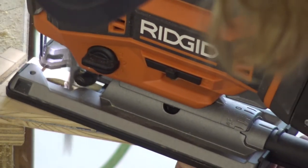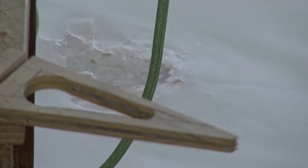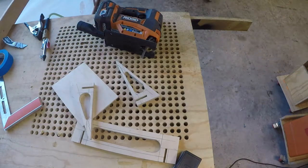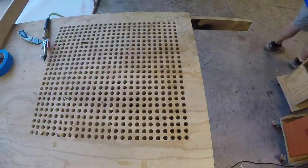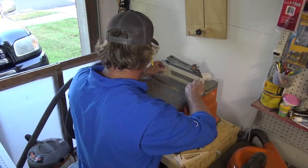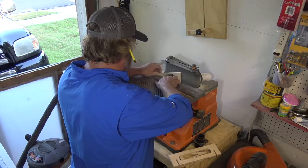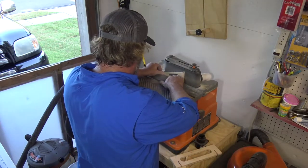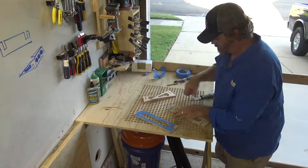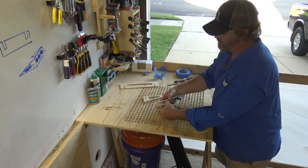That double-sided tape is really gumming up the jigsaw — it's kind of funny. Now that I've got everything cut, I basically have two stands here, so I'm going to separate them and start making the first one. I'll sand it really quick and just get the pencil lines off. I do love this rigid oscillating sander — it is the most versatile tool in the shop. I'll split it apart with a putty knife and take off the back tape. The CA glue is stuck to the tape, not to the wood — that's the trick.